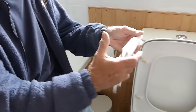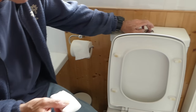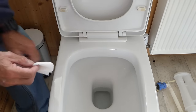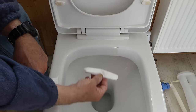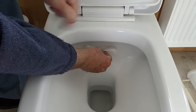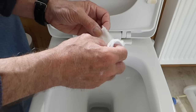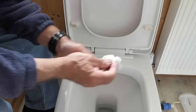So, toilet paper — and do wash your hands after you've done this. I'm going to flush this one simply because there's nothing wrong with mine, but what I'm going to show you is the way that water can run down the back without you seeing it. This is a bit of tissue — just stick it to the back there. The way to properly check is to not flush your toilet for a good hour, make sure no one's used it, then put the tissue to the back like I've just showed you.